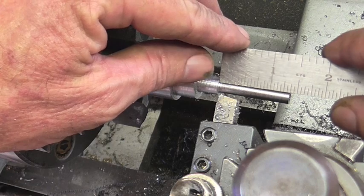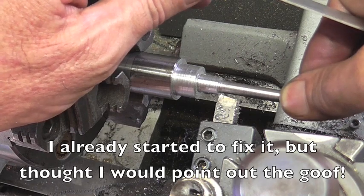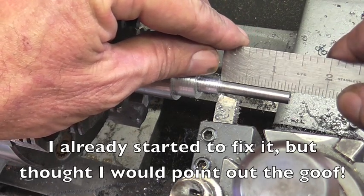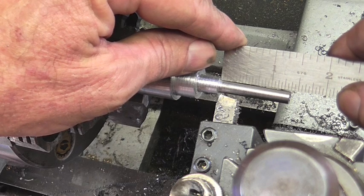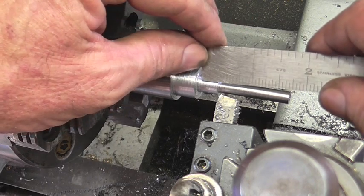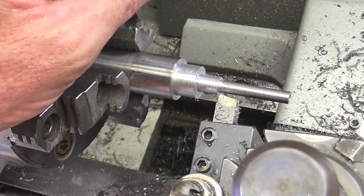Well, I'm not really sure what happened, but I made a big goof over here. This shaft is supposed to be one and five-eighths long, and for some reason when I marked it out, I marked it out at one and three-eighths. So I don't know what I was thinking, but now I have to go ahead and fix my problem - extend this shaft down a little bit and take this piece down to five hundred and twenty-three thousandths.